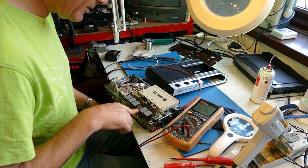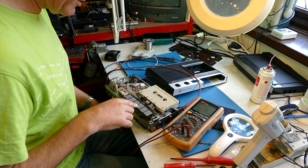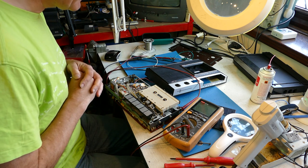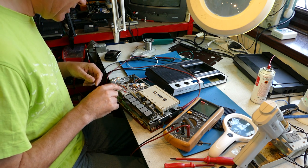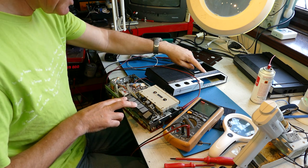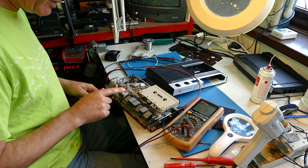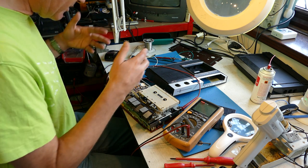Going towards the end of this tape. Any blank tape? Oh good, perfect. Do you have a tape counter? No — that's a nuisance. Go a little bit further. So we've got all this blank tape at the end to play with. So we have to be able to make a recording, and I'm fairly sure there's no microphone on this thing, so I'll have to rig it up. There's a volume on here, so it obviously detects audio recording. So what I'll do is I'll put it into record pause — which I think would be pause down and record and start, I imagine. And it'll sit there waiting for me to release pause. All we need to do is hook up some audio, and we should be able to see the VU meter moving.